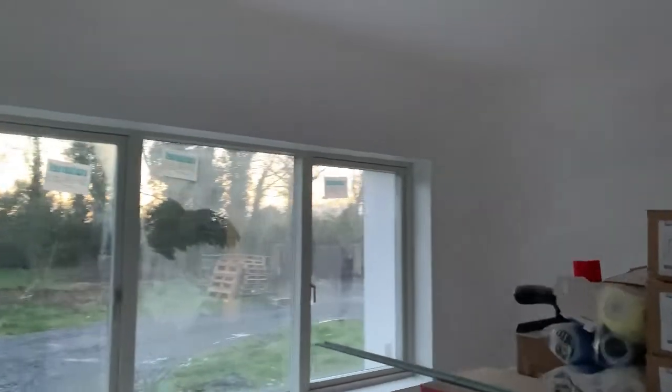It's going really well. The only issue we had was doing the ceilings — it was a little patchy with some lines from the spraying. I think it just takes a bit to dial in the spray machine, which I probably hadn't gotten right at that stage. We've rolled all the hallway, playroom, utility, and the hallway running down to the bedrooms on the ceiling, just to make sure we don't have any lines. All our downlights are cut out, as well as our PIR and single outlet for another piece of art.